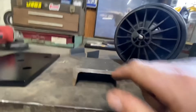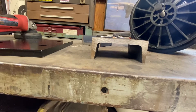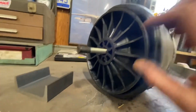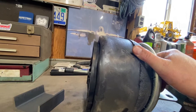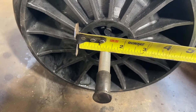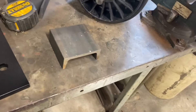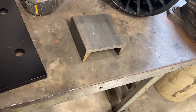First I've got to locate these pieces, which will weld to the top of my plate. The stud hole gets drilled on top and you'll theoretically be able to put a wrench down in there — it's going to be a tight fit. The face where the bag sits only protrudes on the center section — that's about two and five-eighths inches — so that's all the width I need. At a total of four inches, I can lose an inch and three-eighths off that stud, so I'll cut both pieces down on the chop saw.